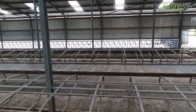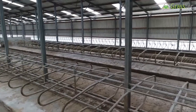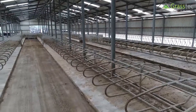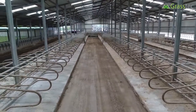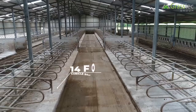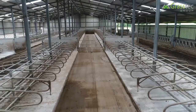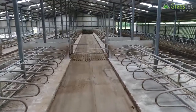There are three double lines of cubicles with self-locking stalls in the far offside. All feed barrier is self-locking stalls. The cubicle bed here is 14 foot. The poles are positioned offset to the cubicle bed, even though the cubicle center is dead center on the offset. The double bed is 14 foot, and the cubicles are six foot — hung on 3-inch pipe.